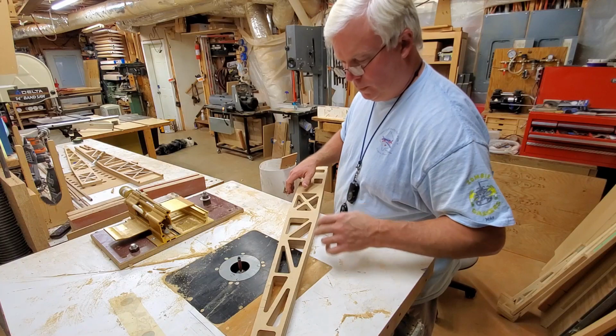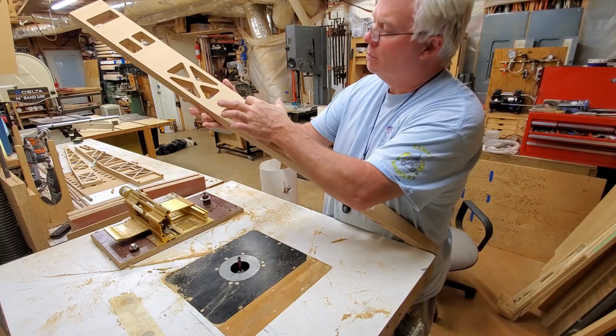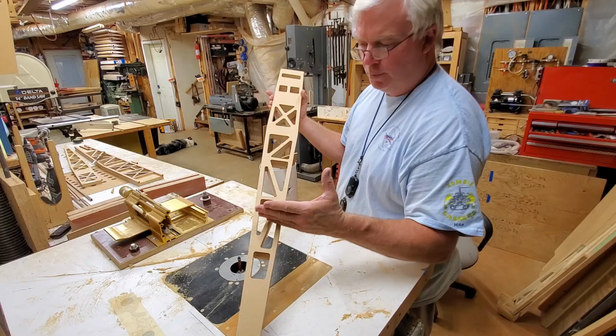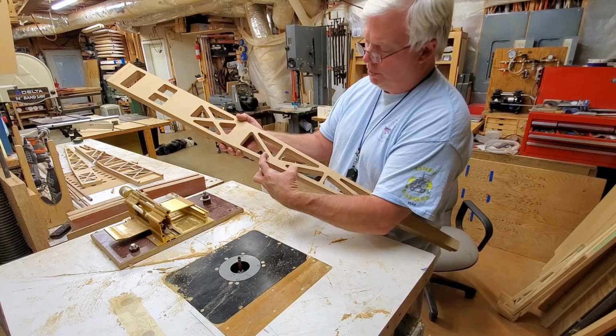All right, so you can see that it went a good bit deeper, probably a good 5/8 of an inch deeper into that cut. And it sharpened our radius on each one of those up. So we probably took, I don't know, 4 or 5 grams off the part just by going those extra lengths there. And if you don't want the sharp corners, all it does is increase the size of this web right here. So if you want that web to be bigger, just run a bigger bit when you're making your part, and it won't go all the way into that corner.